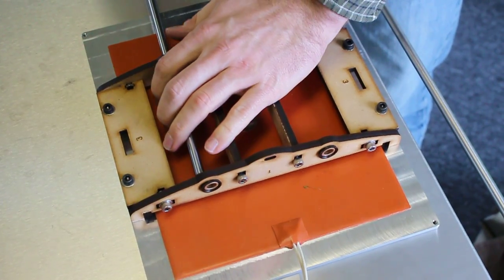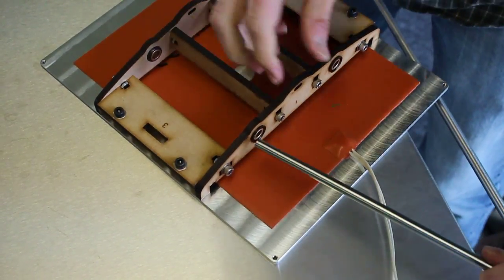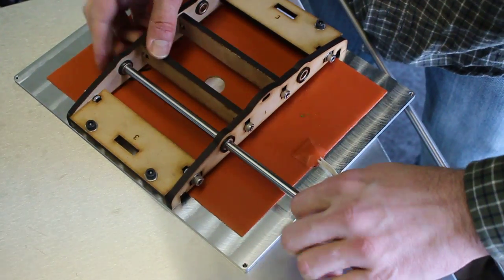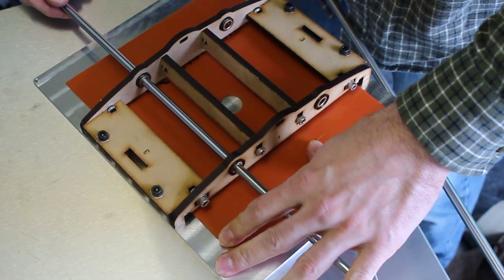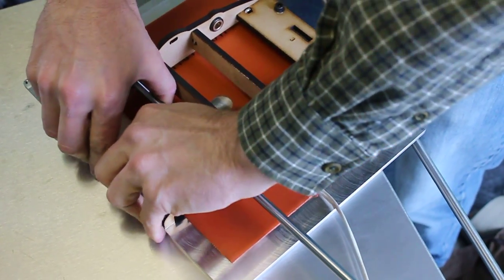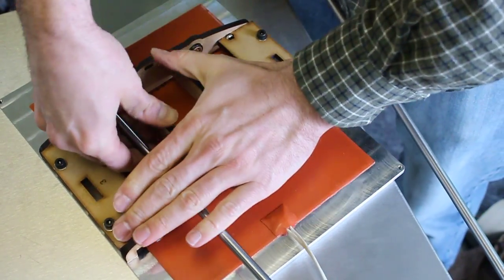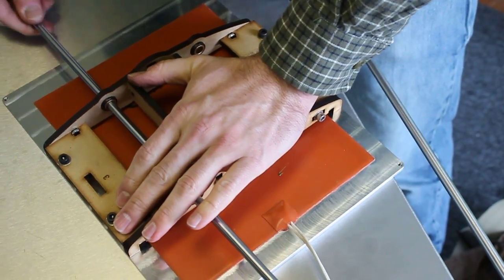Then take the smooth rod and give yourself a lining — just line it up as best you can visually from both sides. When you first push this through, it's not going to slide real smooth. So just grab right in the middle and go in each of the four directions. Push kind of hard, and then up and down. That'll smooth things up for you quite a bit.